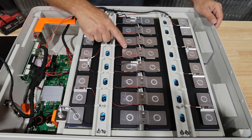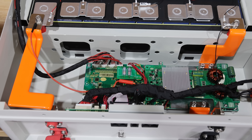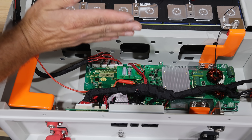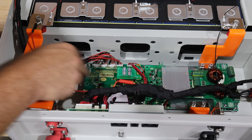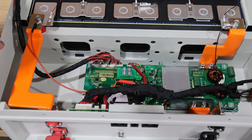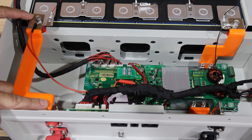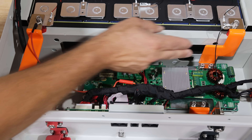You've got all of these red wires — these are all your voltage readings for each cell. These black wires are your temperature sensors; there's a total of four of them. At the bottom of the battery you can see the battery management system. It's different than a server rack battery because it's laying flat, and I think the reason for that is once this is mounted on a wall, the BMS will be standing straight up and down and the heat sink will be up and down as well so it dissipates heat properly. There does seem to be a lot of wasted space. One thing I noticed when I first opened it up — these bus bars right here. A lot of the budget batteries will do like two small wires or even four small wires crimped together to bridge between the battery and the battery terminals. I think this bus bar is the best way to do it, so that's a plus on this battery.